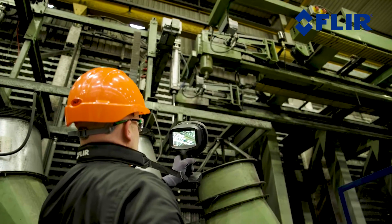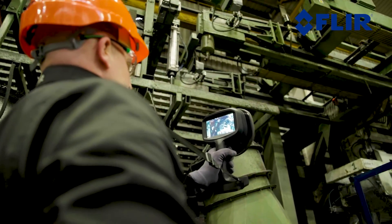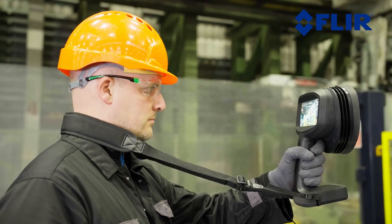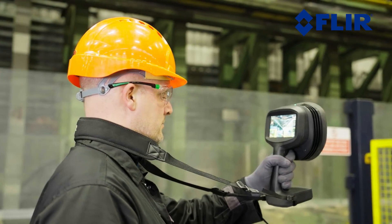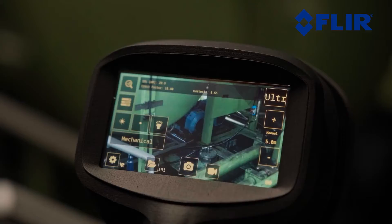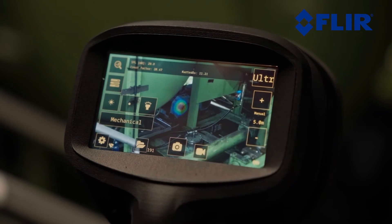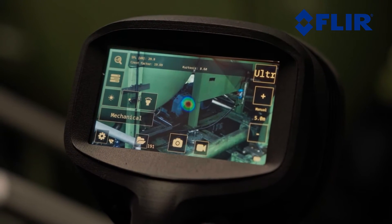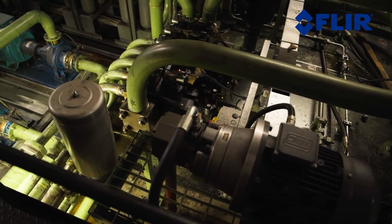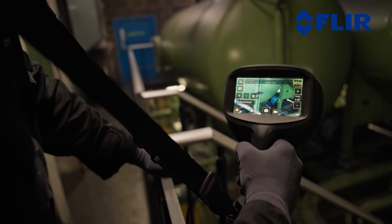The SI2 also detects unusual sounds emitted by deteriorating mechanical components, providing a precise non-contact means of locating faults and optimizing performance in conveyor systems. To detect mechanical issues, set the mode to mechanical. The mechanical mode on the SI2 provides three metrics: SPL, crest factor, and kurtosis. Different types of bearings running at different speeds behave differently; however, the following indicators often signal potential issues with bearings.